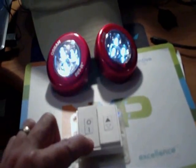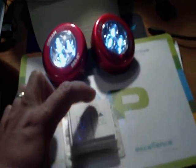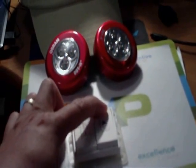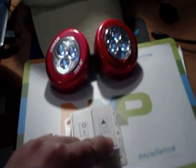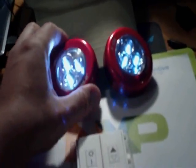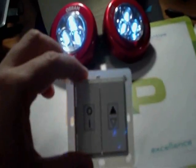I can also dim the light fixtures by turning them on. This shows that a single button press has enough energy to continue reading the switch and to send electrical impulses out for multiple levels of dimming. Again, an NXP JN5148 device working on an IEEE 802.15.4 network — industry standard, worldwide acceptance. Feel free to get a hold of your local NXP sales force with any other questions.